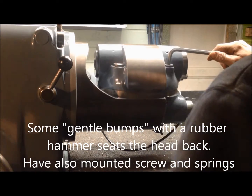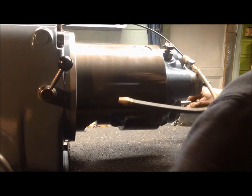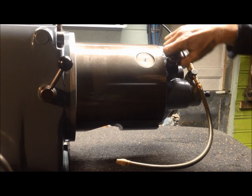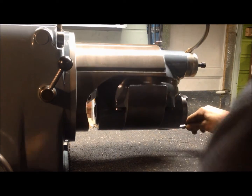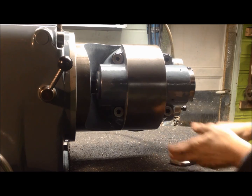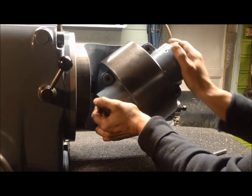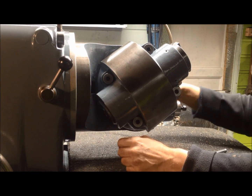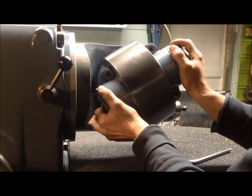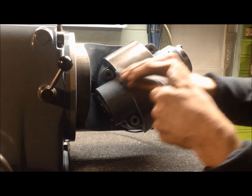Just a short sequence again. Then to tilt the head in that direction, we have this mechanism here. If you unlock the bolts a little bit and then swivel that, you can easily just tilt the head like that. If you leave it in a position like that and then disengage that mechanism, then because of the spring, you can easily hear them clicking into the indexed positions. And then it's just a matter of tightening up again.